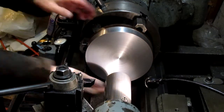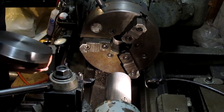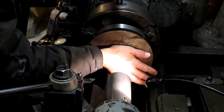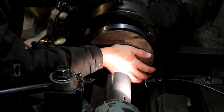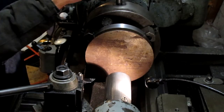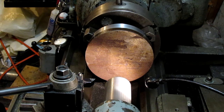Here I'm mounting up the blank that will hold the head and allow it to pivot from side to side in my lathe. I've faced off and turned down one side, just flipping it over. To do the other side, there's a small register that I'll turn into the blank to fit the hole at the back of the vertical head.